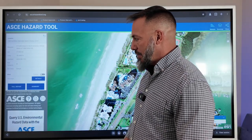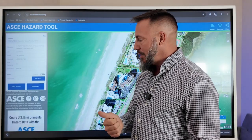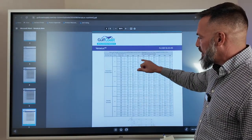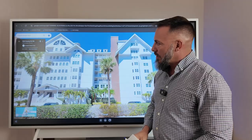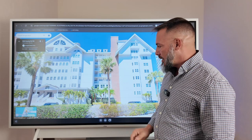My end goal is to convert this wind speed into a pressure so I know what panels I can use and what my fastening pattern has to be. At 154 miles an hour winds, I don't have anything in between on the table, so I have to bump that up to 160. My roof height is 104 feet to that top peak, so roof height is really tall.